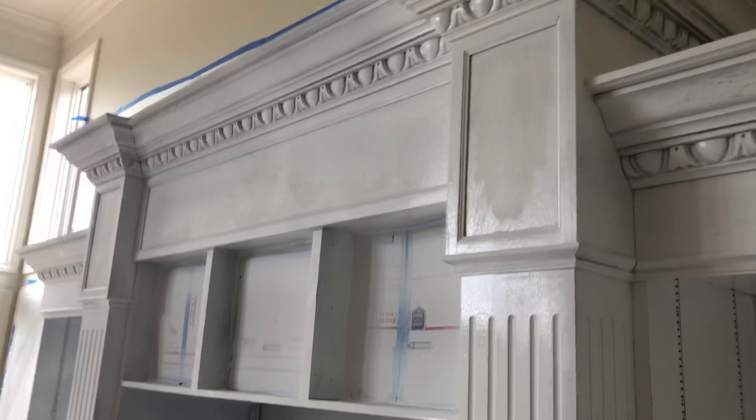So it's not pretty, the first coat — this is just a bonding primer. You don't want to try to put it on too heavy. The real magic happens when we start putting the finish coat. Tomorrow when we show up, this will all be dry. We can sand it, caulk all the big seams, and apply a couple coats of finish.